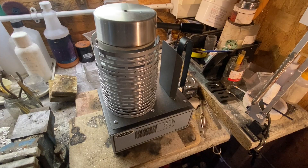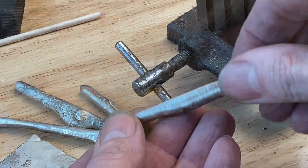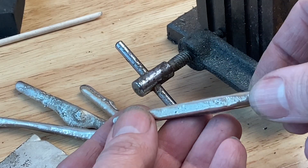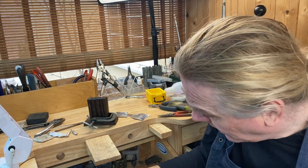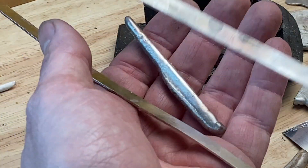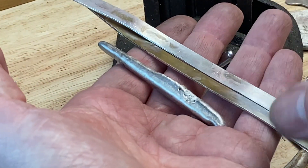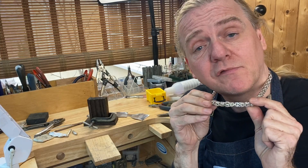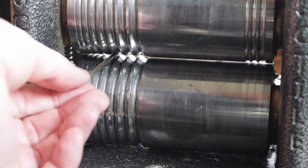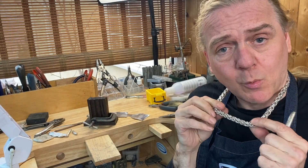So let's go and see to our ingots. It does take a bit of practice, but once you get used to it these things are great for putting through a rolling mill. Literally within a couple of minutes you can turn an ingot like that into strips like this for making rings and bangles. You can keep on rolling it and it moves into wire — for example, my necklace here is all made out of recycled wire. Melt it, cast ingots, put them through the Pepe Tools ultra mill, make wire. You can make anything.